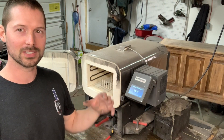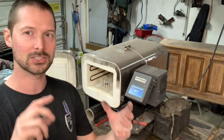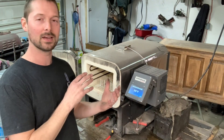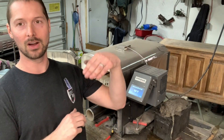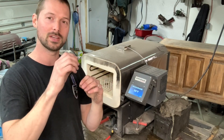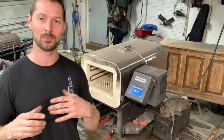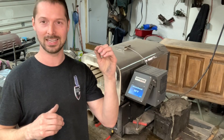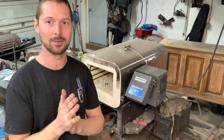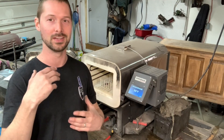The other thing I wish I had done is add a quiet relay or silent relay. When running a heat treat cycle, once it hits temp, the relay kicks on and off to hold temp every couple seconds — clicking constantly. When you're in the shop working, hearing that clicking noise is kind of annoying. Definitely upgrade to that. I don't remember the exact cost, not much. But you're making this investment, so just make it to where you're happy with it for years to come.